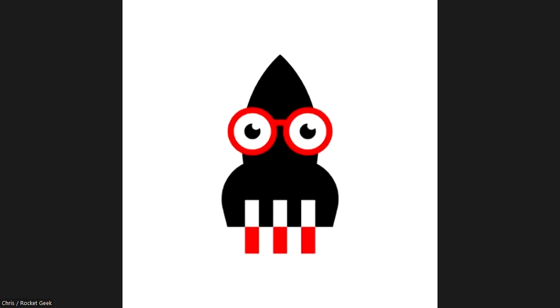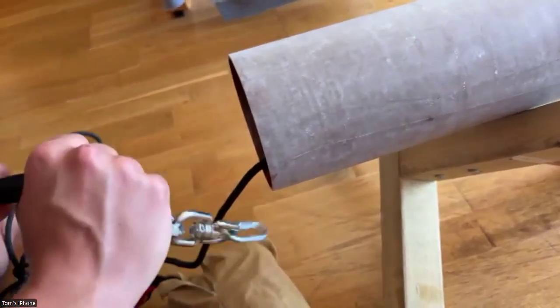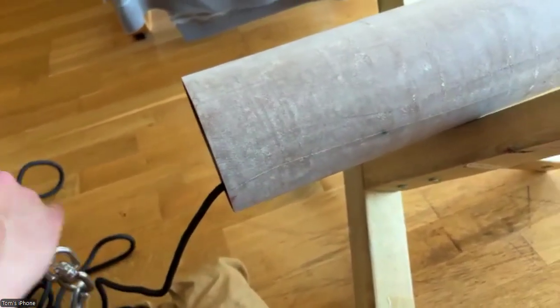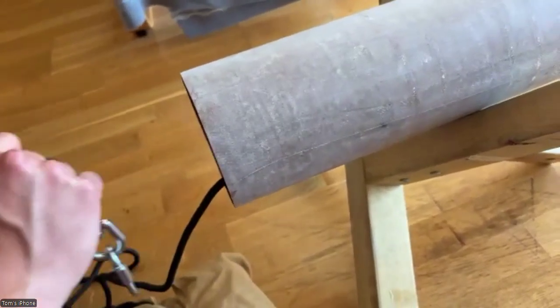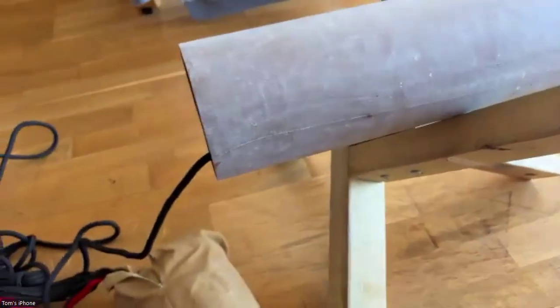How are you arranging your shock cord in there? When you fold and pack the parachute and everything, how are you fixing your shock cord so it's going to come out in a nice orderly fashion? We've previously used masking tape before packing it in, which should keep everything nice and ordered while it's in there and prevent anything from tangling or knotting as it all comes out. And then obviously it'll rip out quite easily as it unfolds. Right. It kind of helps cushion things a little bit too, because Kevlar's got no stretch to it like nylon does.